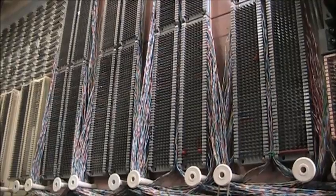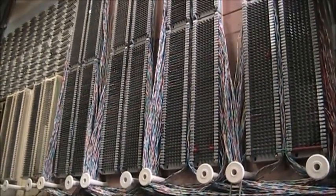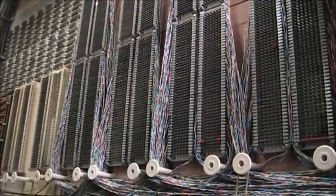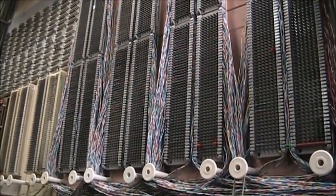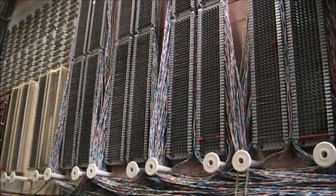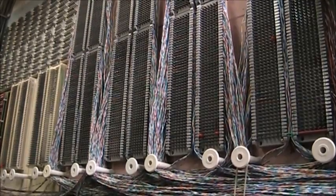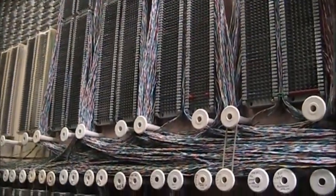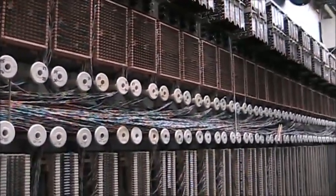I have multiple satellite terminals and lamp repeaters in the satellite closets. There's a massive amount of cross-connects, and within my telephone switching office I also have one line that appears in all of the telephones, as well as in the other buildings. All phones within a building have their own dedicated line, and then each individual telephone set has its own telephone number. So on a standard 6-button 2565 phone, lines 1, 2, and 3 would be common; line 4 would be the building line; and line 5 would be that specific telephone set. There are thousands of feet of jumper wire going between the KTUs and telephones.